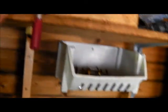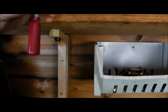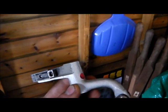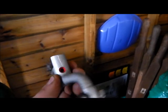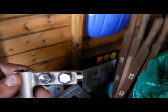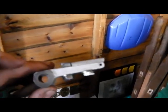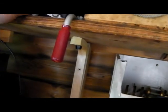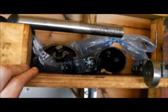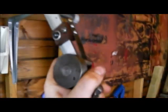Starting handle — painted that, that's finished. This is the little detent lever, it sort of latches into the rocker arm to hold the exhaust valve open. I've just painted the old hole there red and I'll do that on some of the other ones on the engine as well. Cleaned up all the fixings, so that's ready to go back on. Always remove paint from the working parts, otherwise they can bind or stick and just don't work quite as well. There's the cam, finished that a while ago. This is the rocker arm for the exhaust.